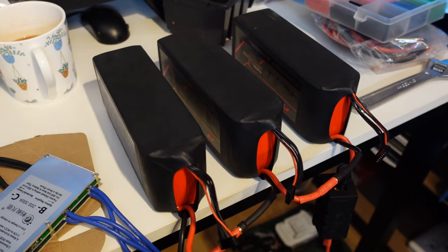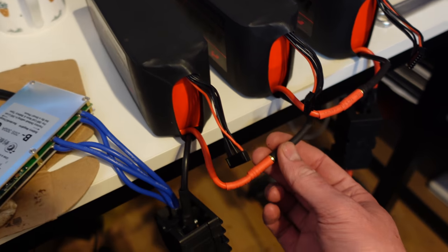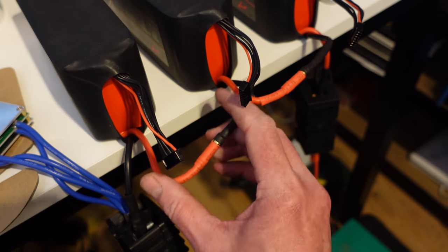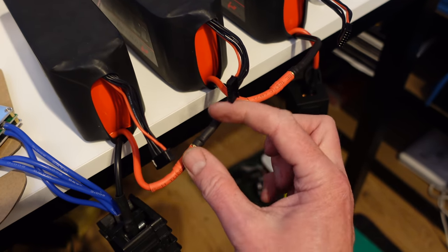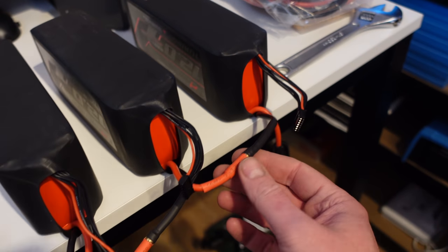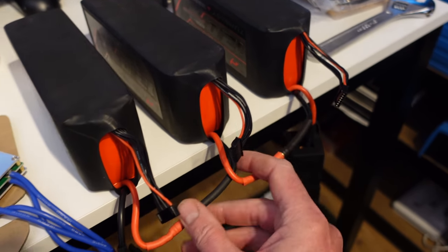It's taken a little while to get going, but we're moving now. Steve's got the tunes on — old school. Right guys, so finally a bit of progress with the battery. I ended up using 5mm gold connectors to link these together. I'm going to put a bit of heat shrink over the top of each one so it doesn't come loose and doesn't have any chance of shorting on anything.